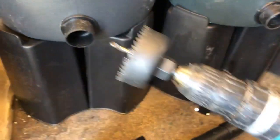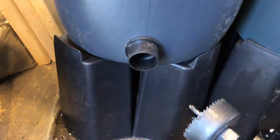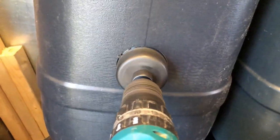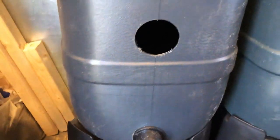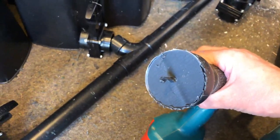There we go, guys. Right, slightly bigger hole saw from the one for the inch and a half. Basically just measured up a centimetre from that line. Bang the drill in. Nice and steady. Drill it out, and then remove the core plug from the inside of the drill.